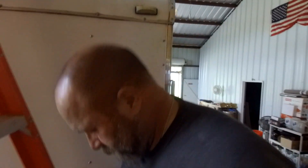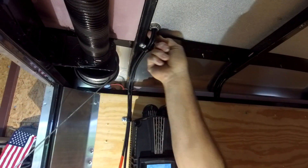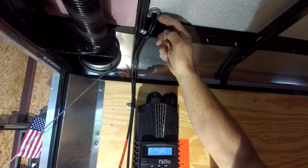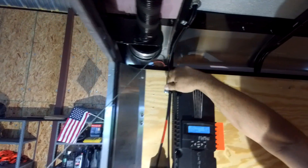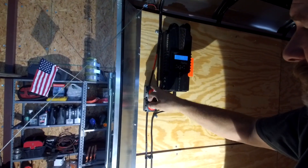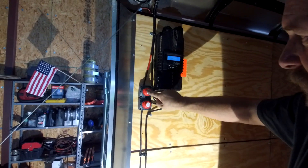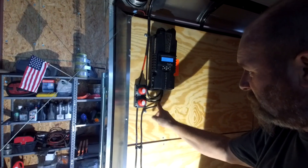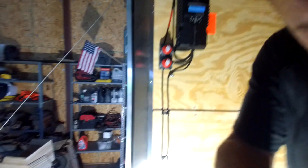All right, go inside and I'll show you this. Up here is where it comes in — the nut and washer — and I've made a nice bend here so it won't abrase and cut on the insulation. Put a keeper right here and right there, into the switch. You've got your positive, which I've marked with red tape, and positive comes in — then inside the charge controller, the negative goes straight into the charge controller. So I can turn the panels on and off with that switch.